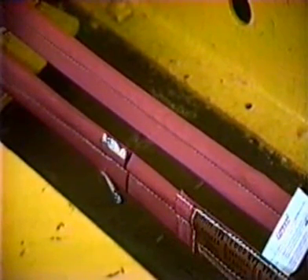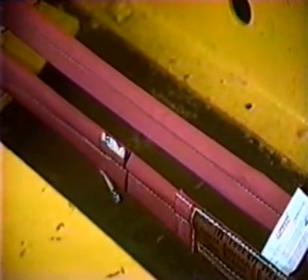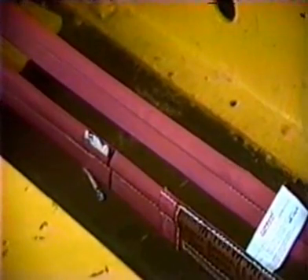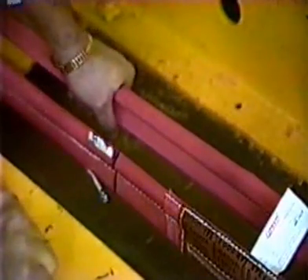I'm the closest person to this sling. When these slings break, we have never been able to actually part one into two separate pieces — there is no devastating whiplash. 75,000 pounds — you see the cover fails and moves away. 80,000. 85,000 pounds. 90,000 — hear that? It's starting to talk to you. 95,000.